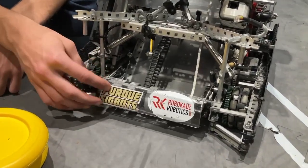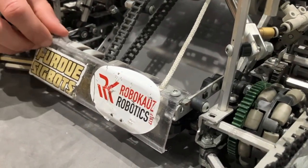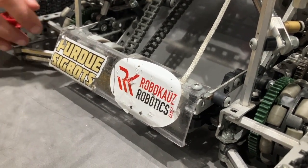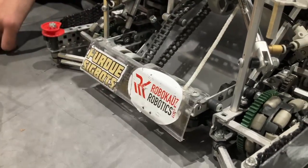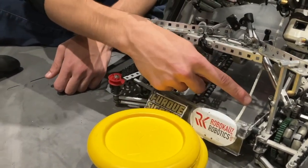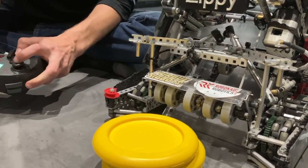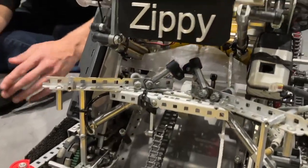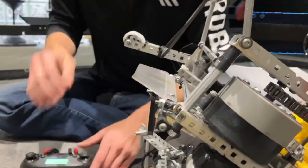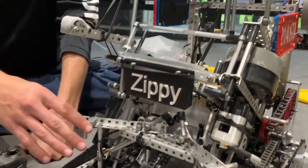The bottom roller is a floating roller. We braced it with a high-strength shaft to take up less area and provide more strength — we originally had L-channel but something bent it and jammed everything, so this worked better. We had a Lexan guard on it just to knock over stacks. This bottom roller is also active: a string goes to a cylinder at the bottom of the robot, and when fired it goes up. That cylinder also doubles as a blocker for that gap, so we could do match loads and continuously run the intake without disc going back down through the intake system.